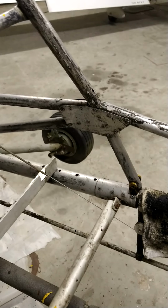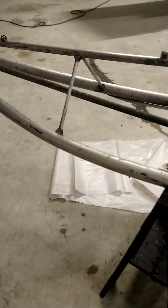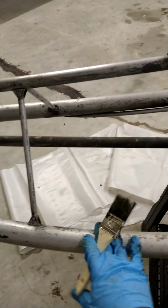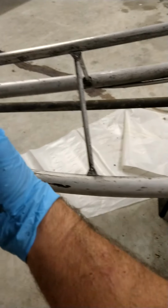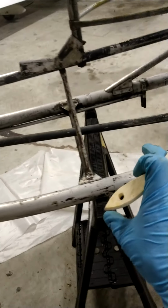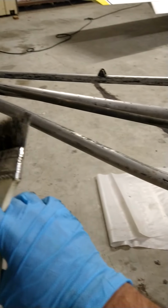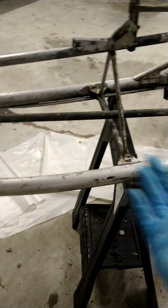And plus, there were also some concerns I had. I wanted to do a dye penetration test. A lot of aircraft mechanics use that system, where we take a red dye. It's like a spray can. First you clean up the area, you spray this red dye on, you use a cloth and wipe it up until it's clean like this. And then there's an activator, and I forget what it's called because I haven't done it in years. You spray that activator on top, and it's clear, but it reacts through UV, I guess.